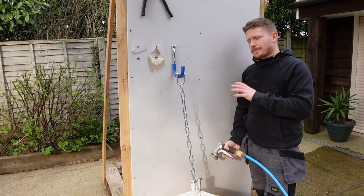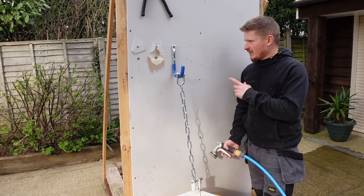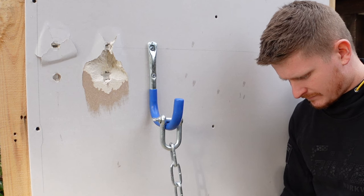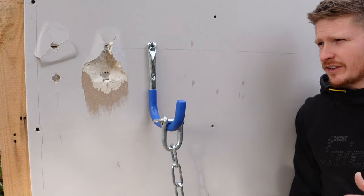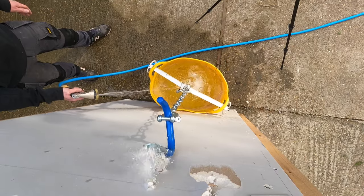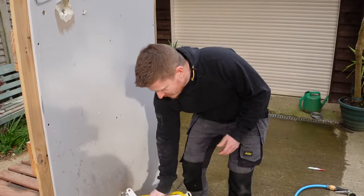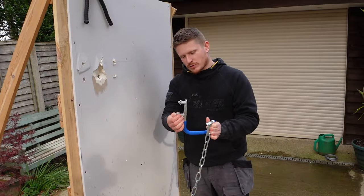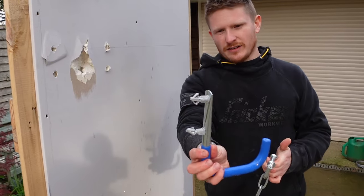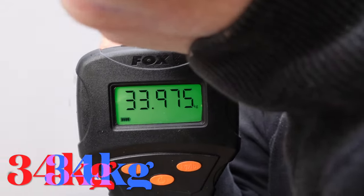I'm not expecting a great deal out of the Fisher nylon plasterboard fixings, to be honest. They already look like they're starting to pull through, so I don't think this one's going to last too long. I'm fairly confident they're already exceeding the rating on the packet. As it was pulled through the plasterboard it actually spread out and held the weight really well — you can see there how spread out they are.